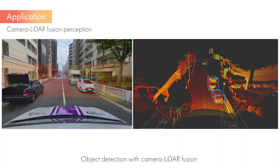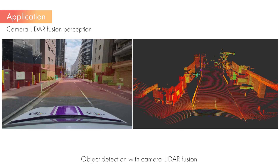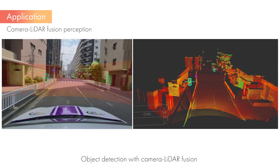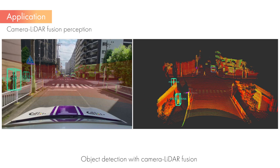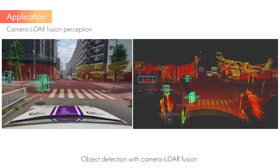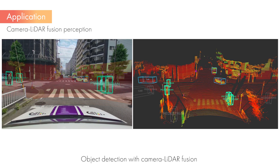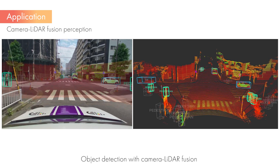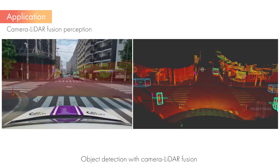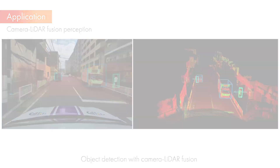Finally, here are the results of Sensor Fusion that combines the object detection results of the camera and LiDAR. With LiDAR, you can acquire three-dimensional shapes, and with the camera, you can make accurate class estimates. By combining the characteristics of each, you can achieve reliable detection results. This kit allows you to use the recognition applications implemented in Autoware. Source code is publicly available, and the hardware configuration and detection model can be flexibly changed to match your application. For more details about this kit, please check the link in the description section.